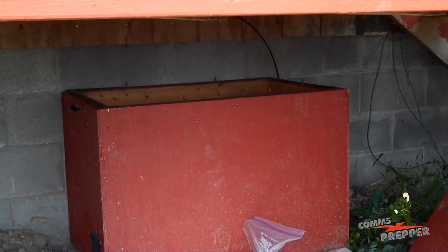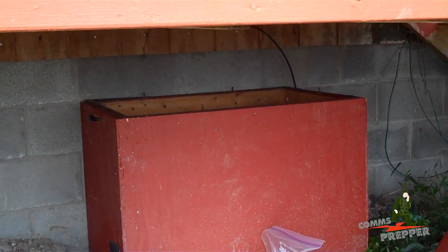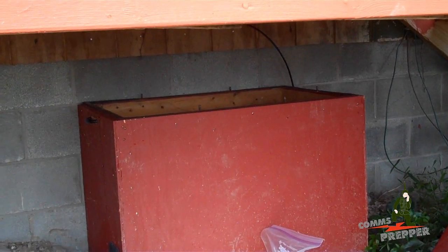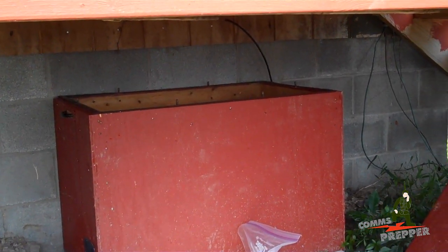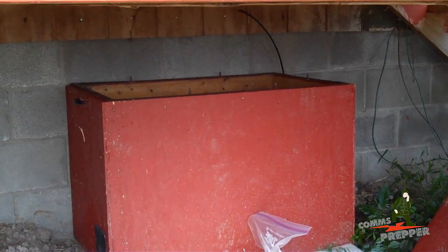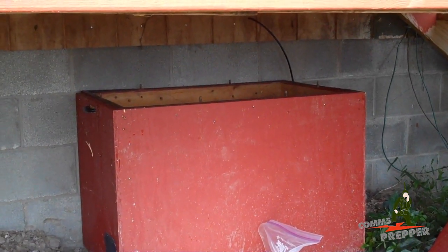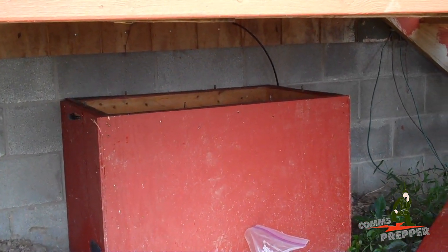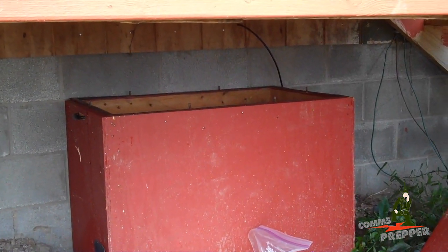We just got out from underneath the deck. We checked the 12 cells — there are three cells per battery and I have four batteries. The readings are within average, but there are some differences between the cells and between the batteries. So we're going to run the equalization cycle this afternoon. We're going to have a nice sunny day, so the charge controller will be able to reach the current and voltage needed for a two-hour equalization cycle. I'll record it in the log book that we did our equalization for August.